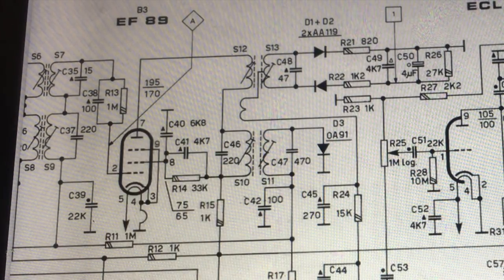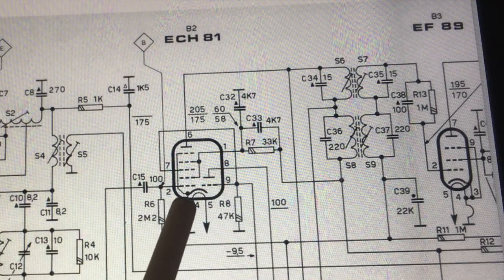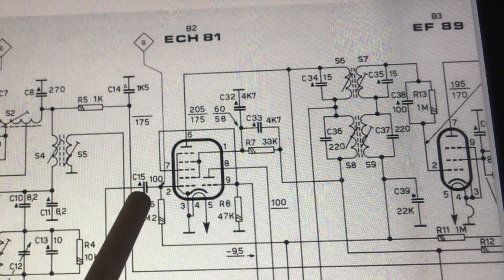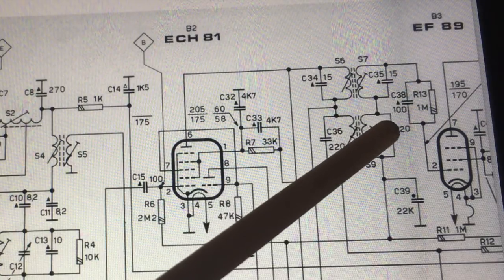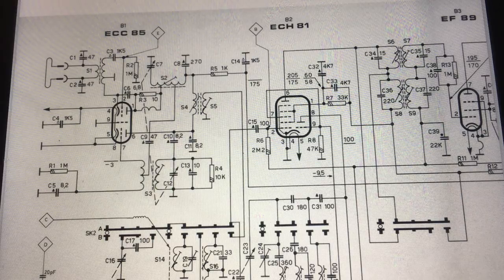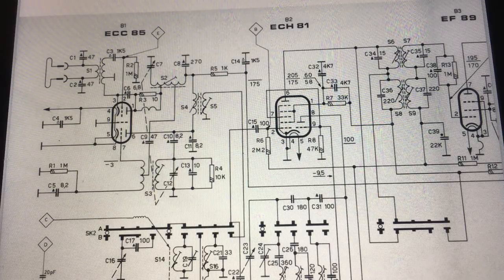Then you're moving it back one stage to before that previous IF transformer, which means that you're moving it to here. That's point B, as you can see over there. So then you move the signal to the input of the mixer oscillator. Same signal, 452 kilohertz with a modulated audio signal on top. And you adjust those two transformers, which is 8 and 9, to give you the peak. And the way to measure this is to put a scope or an AC voltmeter across the output.